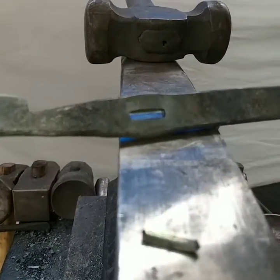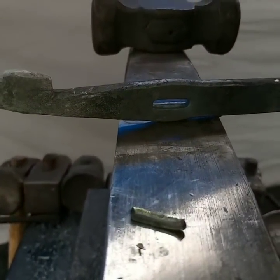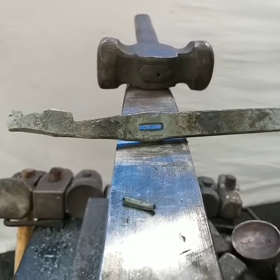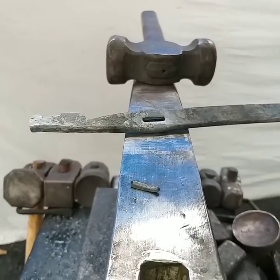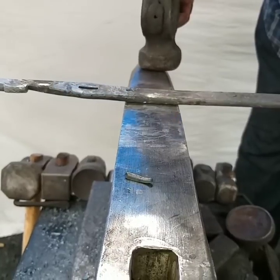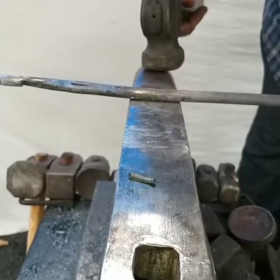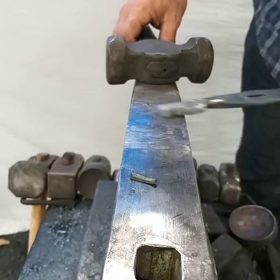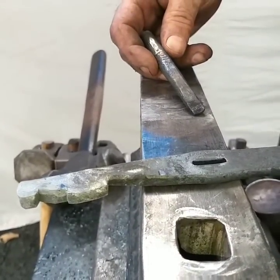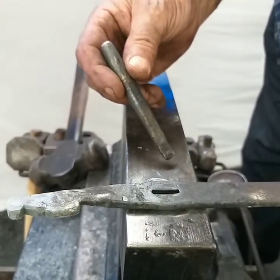And yeah, this 1020 acts quite a bit different than the A36 for punching and stuff. It does tend to drag more. And you'll see when you're drifting too. It kind of acts like copper and stuff does when you're drifting. It has some drag to it because it's soft material. Oh. All right, I'm going to talk about this undersized slot opener.